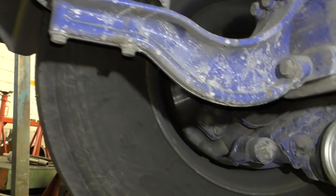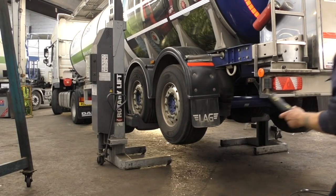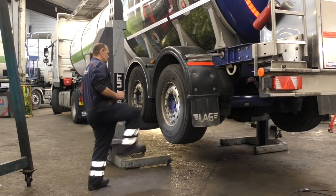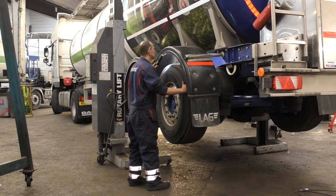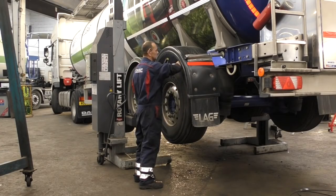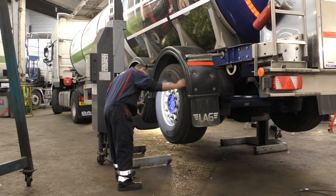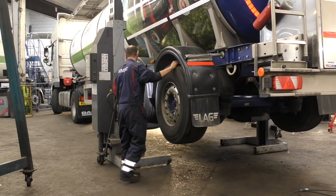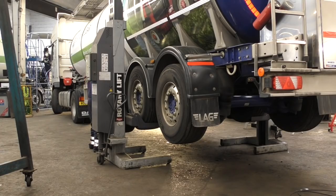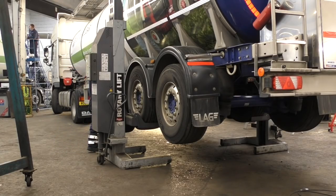Looking at the brake servo here - the black part is a spring mechanical brake. A big part of inspection and service is to check wheels, tyres, wheel bearings, brakes, etc. I'll kick the wheel here so I can free off the caliper - if it won't spin freely, then I know the caliper has issues with the slider pins. I've also got to check the treads and everything else around the wheel. Inspection usually takes about two hours. I've got these on two lifter ramps, so what I'll do is the front and rear axles, then move to the middle axle and service that.